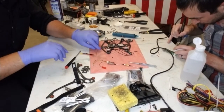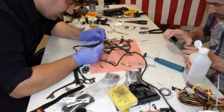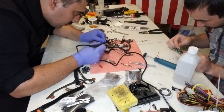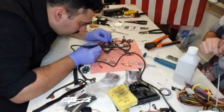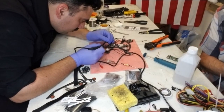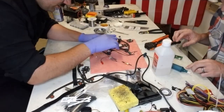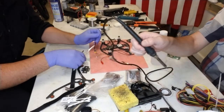This is Titan Reaver from the future, editing this to talk about the build process. This was the first time either of us had built a quadcopter from scratch, though we have done a lot of soldering on very small circuit boards. A couple of things I wanted to discuss specifically were choosing the correct tip for your soldering iron and the soldering temperature — topics that don't get covered much in build videos. We found that the very narrowest tip worked well for flight controller connections.